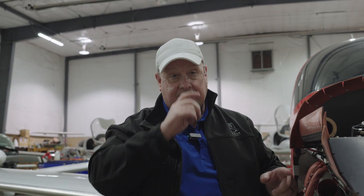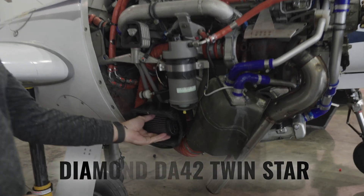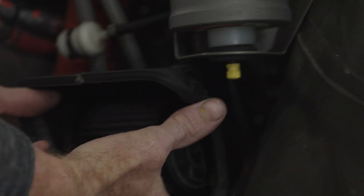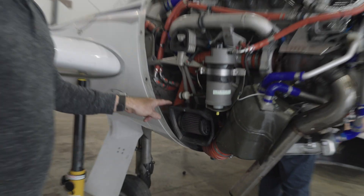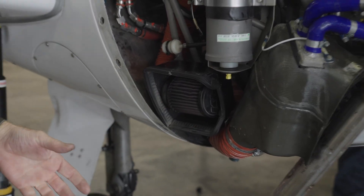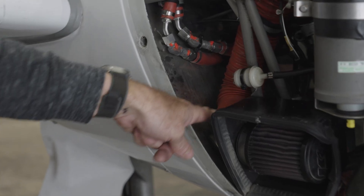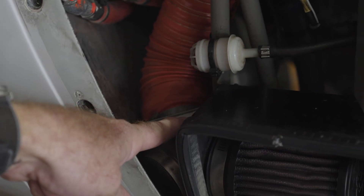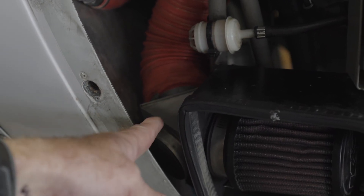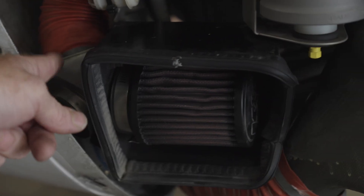Now in the SR-22T, there's a magnetic door. Our inlet air system has an air filter which gets its air from a lower cowling, and we have an orange scat tube that goes up to the turbocharger. We have an alternate air system that bypasses the air from the air filter in case it gets iced over or wet. The alternate air valve is this silver triangle right here. When the pilot pulls the alternate air valve on, that pulls on the alternate air for both engines. At that point, we are taking unfiltered air from inside the cowling, bypassing the air filter to keep the engine running. That's our alternate air system for the DA42.